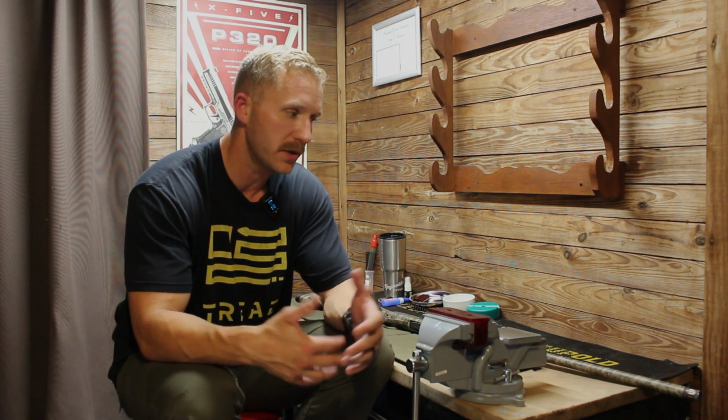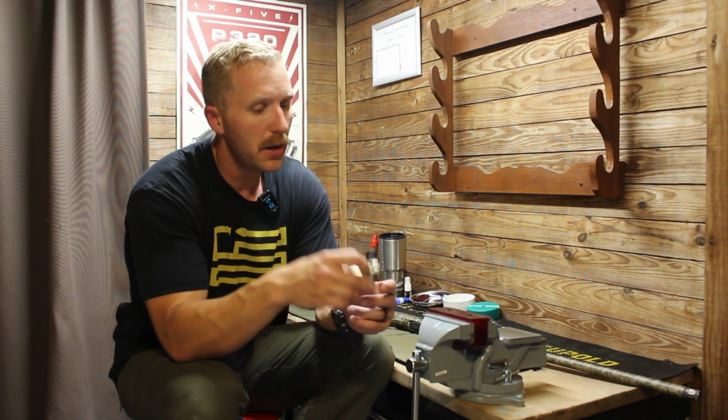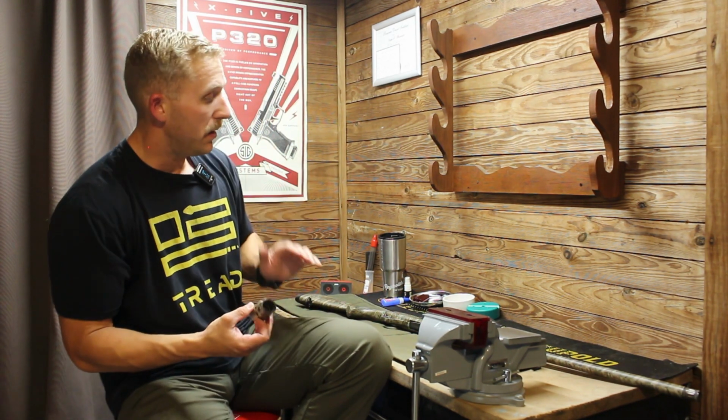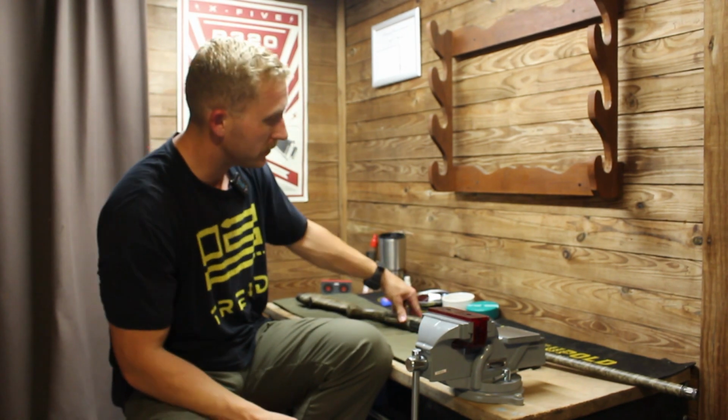If you've got a gun with a lot of age on it and it's starting to malfunction, and no matter what you're doing to clean it, it could very well be the springs are too light or just completely worn out. You might need to replace parts. But he unfortunately didn't necessarily need these parts. The main issue was the buffers inside the receiver.